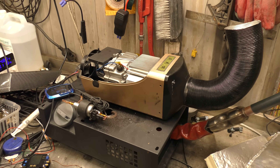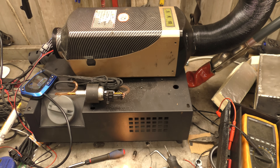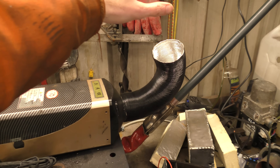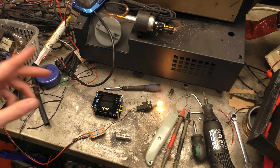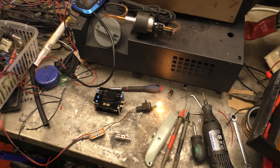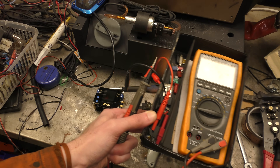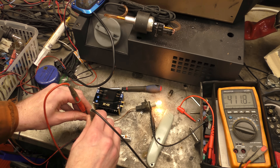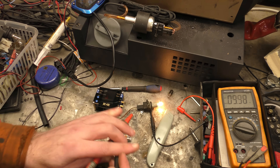Let's put it back together and fire it up — I'll bring you back once it's up and running. Right, well, we are up and running, the heater is still running. They are still giving out hot air out of the hot air output. I have attached this 12-volt bulb to the output wire from the TEGs. What do we get on the output of the TEGs? We have 10 volts — just a nice round 10 volts.